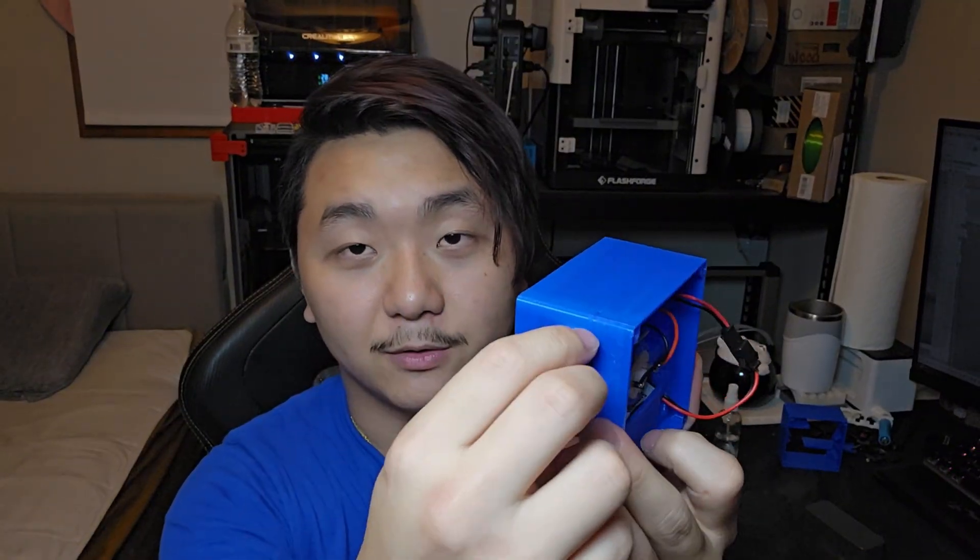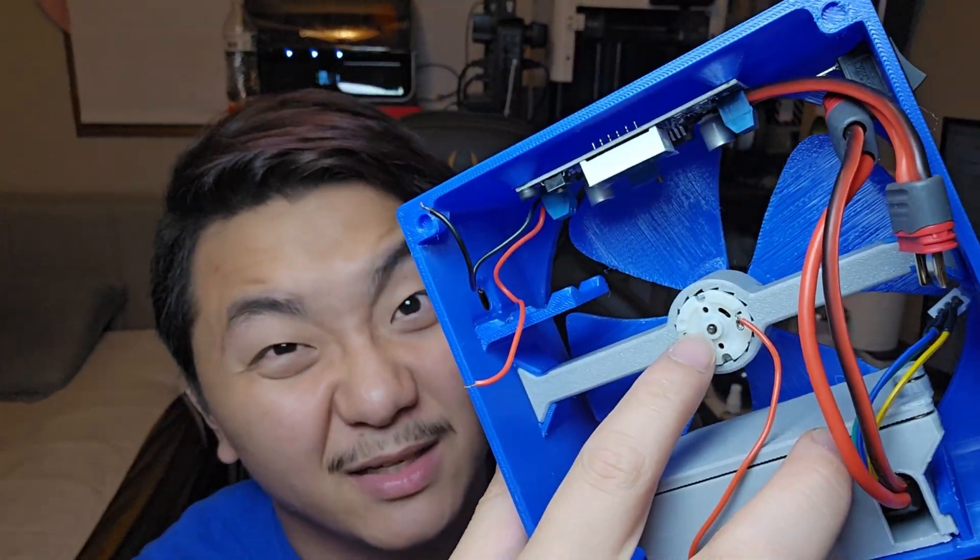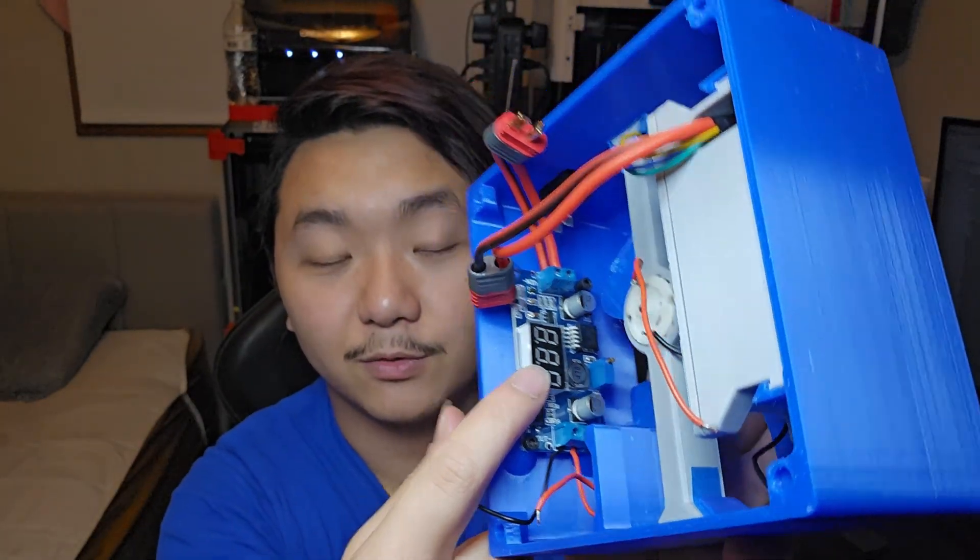It's very simple. It just consists of a box, a fan, a motor, a speed controller, and my own DIY battery. This was the first model that I made because I just wanted to make it big and very strong. But apparently, this motor kind of got stuck. It was rated for 6V, so I made a 2S battery in here. I also have this voltage controller here where you can turn and lower the voltage. I lowered it to 6V and the motor was still frying. So I decided to make a smaller version and this one is very cute in my opinion.